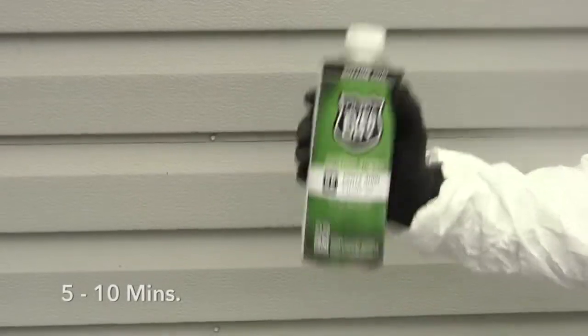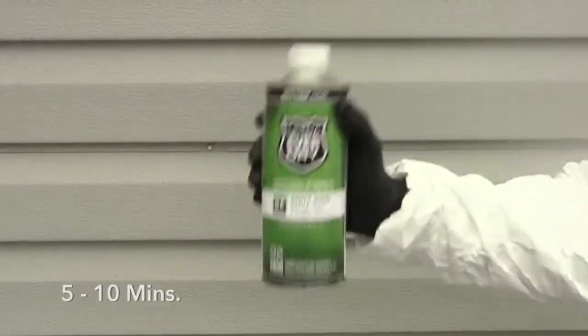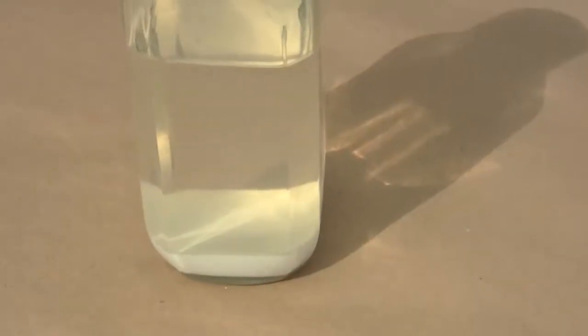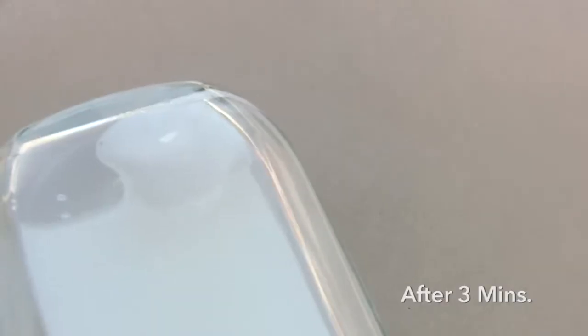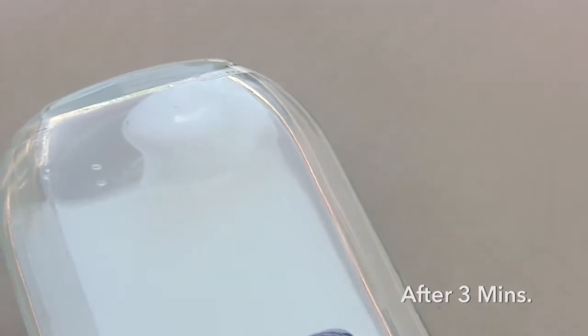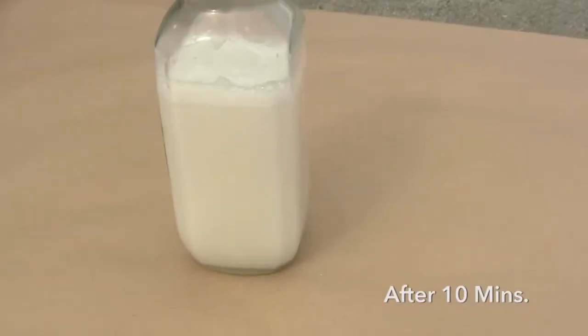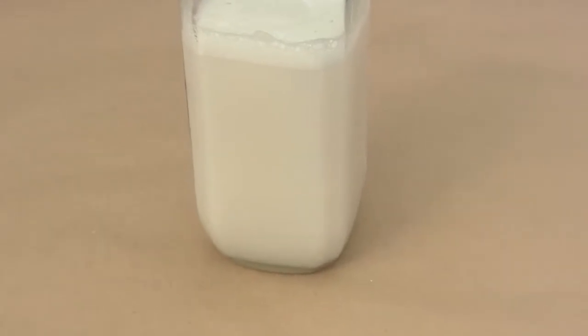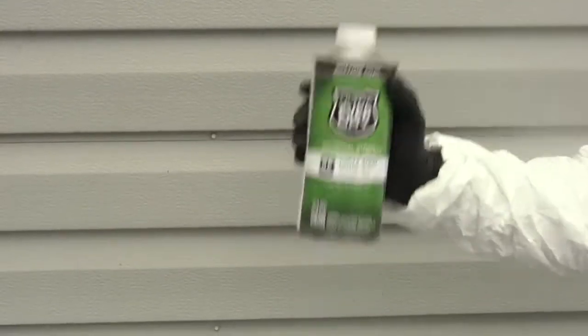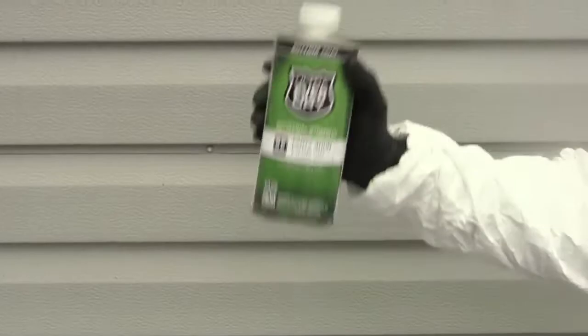Prior to applying the bottom coat of Ultra EverDry, mix it thoroughly for at least 5 to 10 minutes. This is necessary because as the containers sit, the polymers settle on the bottom. Without sufficient agitation, the bottom coat will not have the necessary quality to bond with the surface being sprayed. This will result in shortened lifespan of the sprayed coating and in some cases, very little water or oil repellency of the final coating.